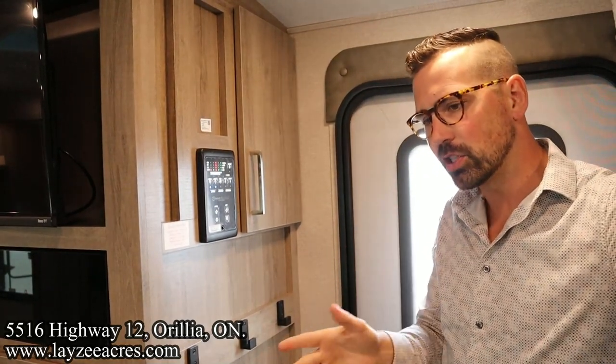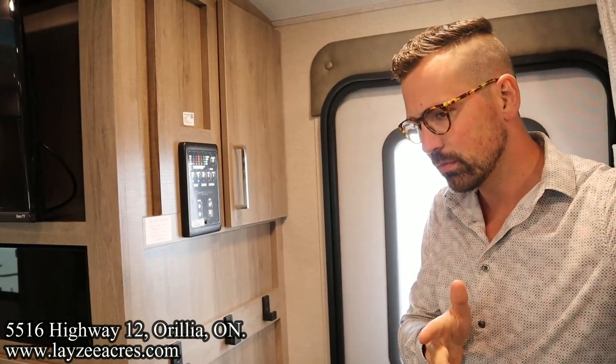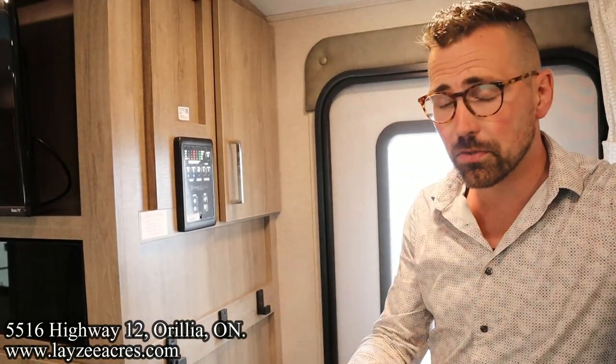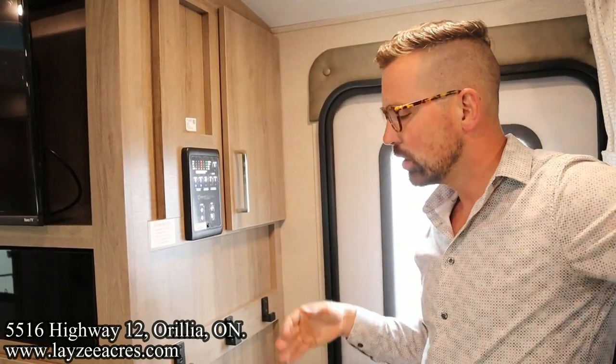One point on propane, and Brendan, you know this because we've done so many of these videos now. The first thing you light is what? You light the stove first, which gets the gas running through all the lines. Yep. Stove top. Especially because you'll have air in the lines. If you haven't used it all winter or haven't used it for a month, always light your stove top first before you go to try to light anything else. So we'll go do that now.